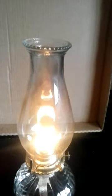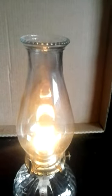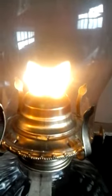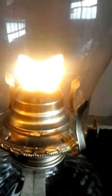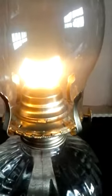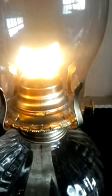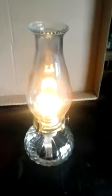That said, I had trouble with one of these — it wasn't burning as good as the other. So I decided to pull them both apart one day and do a comparison. I wanted to find out why one had a wider, nicer wide flame. One of these had a narrow flame. The better one had a wider flame, more square, and it was brighter — almost a yellow or white colored flame instead of orange.